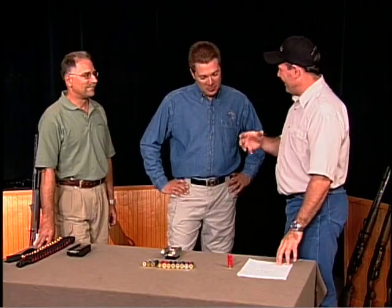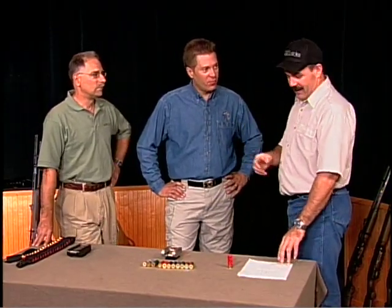And the way it works, it's a certain amount of powder, so a 3-dram weight of powder pushes a certain weight of shot, whether it's an ounce, at a certain speed. Yeah, and so your velocity will change with your dram equivalent and your shot weight. So you can have a, this is how it works. It's really basic, but it's a mystery.